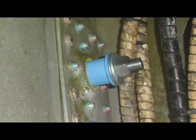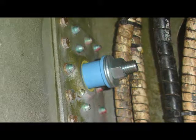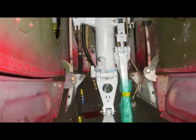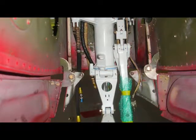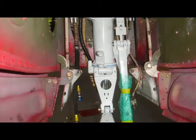The new Aerotuff grease-free bushing is being pulled into position in the trunnion plate with the same rig. Notice that the Zerk grease fitting has been removed and replaced with a stainless steel tapered plug. The trunnion pins have been fitted and the new gear leg from Marsh Brothers installed. Notice the blue band of Aerotuff in the middle above the steering collar — this is a favorite point for grease starvation and an important reason for fitting Aerotuff.